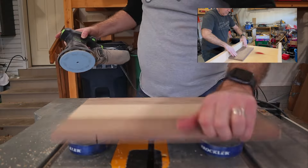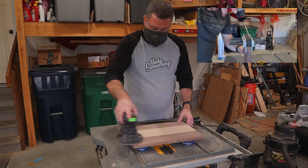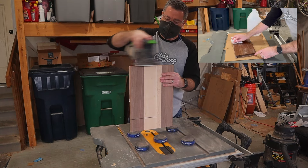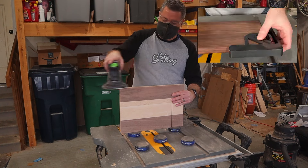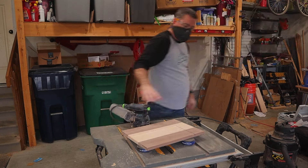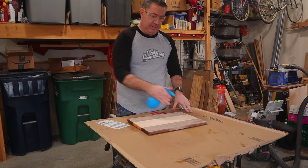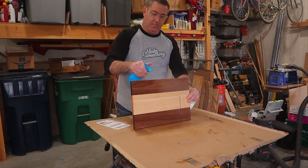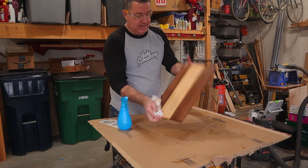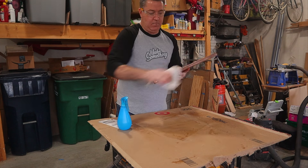This walnut maple board is actually the second board that I have made with these built-in cheese slicer kits. If you'd like to give one a try but want a simpler design on your first attempt, check out my video where I make a smaller board from a solid piece of walnut — that board was simply cut to size and had the groove cut all the way across its width. One important thing I do on every cutting board I make is to raise the grain by spraying it with a bit of water. Not only does this give you a nice preview of what it's going to look like once you apply oil, but if you don't raise the grain and sand it one final time, it will happen the first time the board is washed and it will always have a rough feel to it.